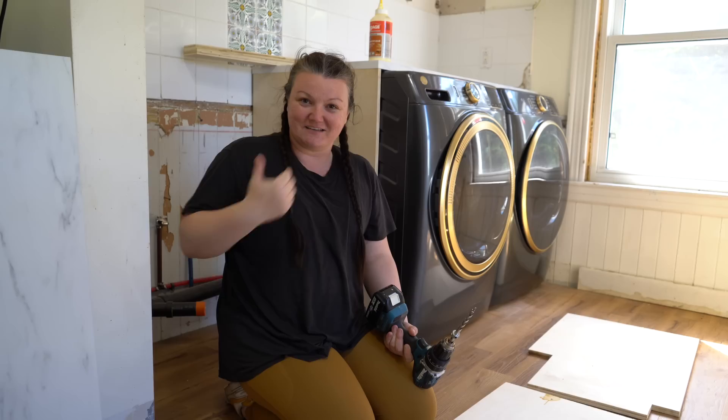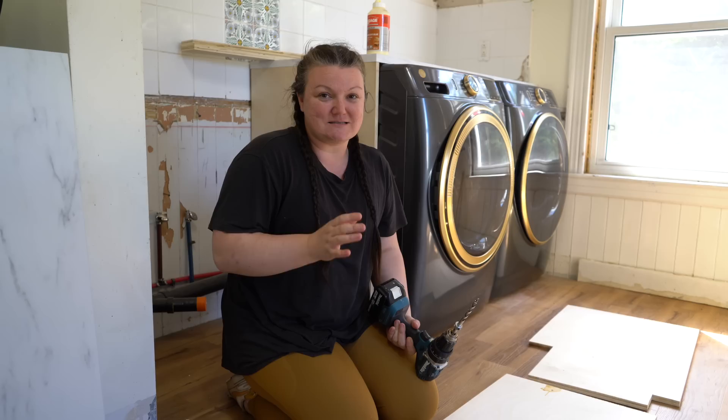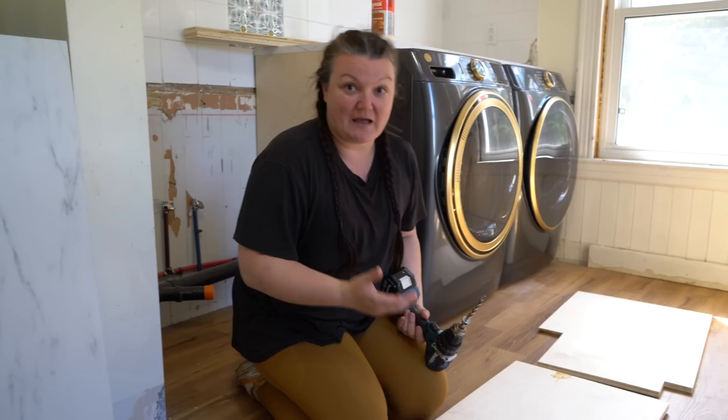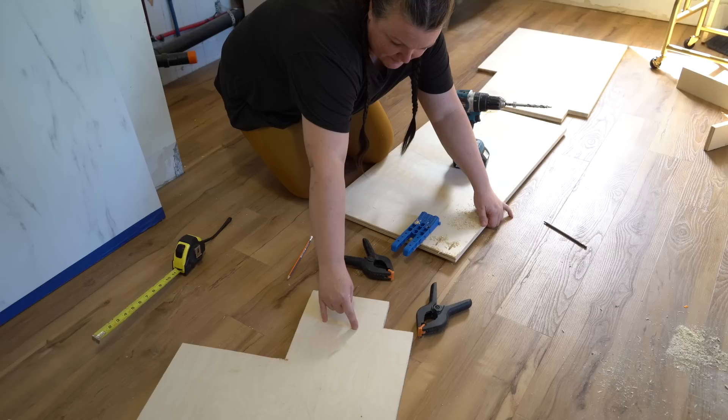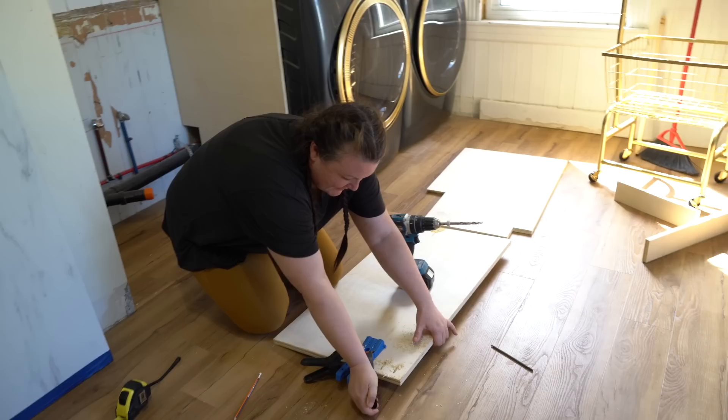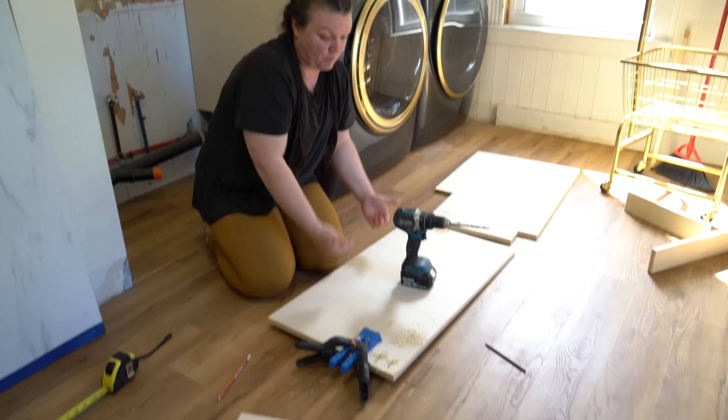Last night before bed I insisted we could cut some of the pieces needed for this cabinet to be built and assembled. I'm going to do that first, then we're going to brace up that heavy sink. I have the cutout here for the toe kick, and this is the only space I have to put pocket jigs because I had to have a cutout for the plumbing. On this side we're going to put a couple extra screws for support, and I've compensated by making additional support for underneath in the middle, because that space wouldn't have extra support on that back corner because of the plumbing.